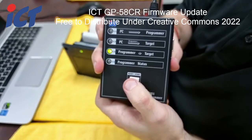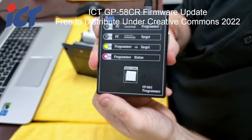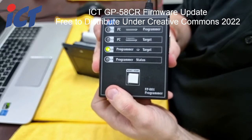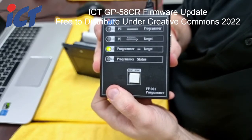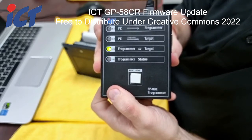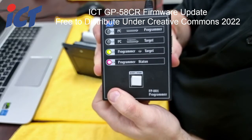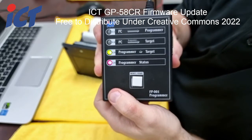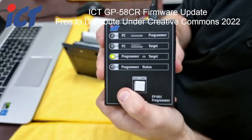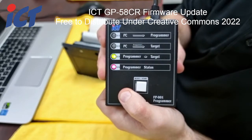Hit your white button once, which will cause your L4 light to go red for a second, go out, and then start flashing. This indicates that the process has been started and your printer is in the process of updating its internal software.